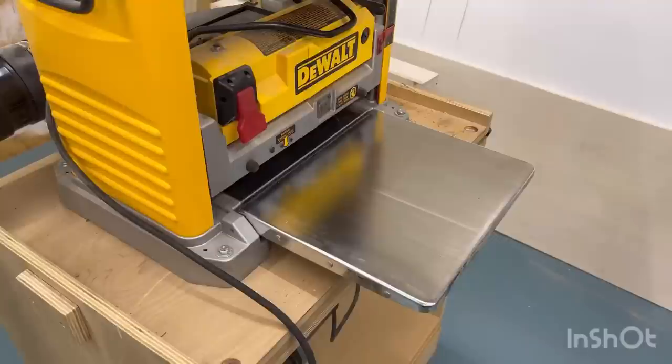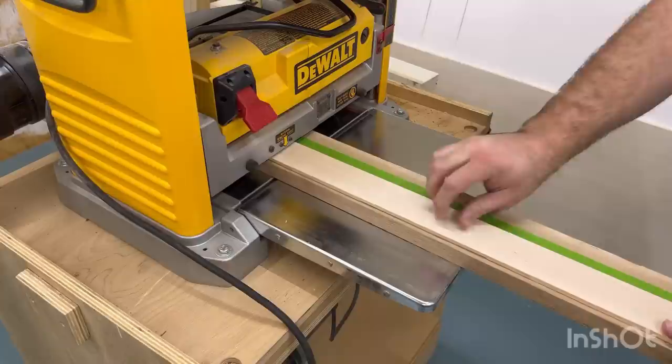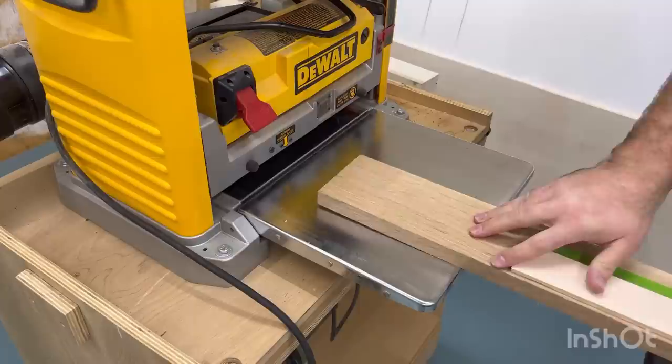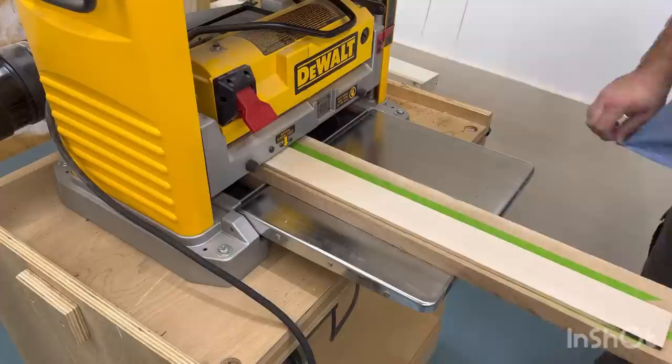The bandsaw leaves a rough cut mark, and the strip still wasn't thin enough because I'll need to bend it without it splitting. To remedy both of these issues, I could now take the strip to the planer to mill it thinner to how I'd need it. The planer bottoms out at a quarter of an inch, and I need the strip closer to an eighth of an inch thick, so I used a trick where I put painter's tape on the maple, put painter's tape on the thicker piece of oak, and use CA glue, also known as super glue, to temporarily but strongly bond the two pieces together via the tape.